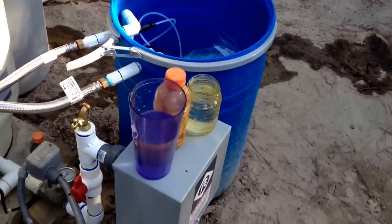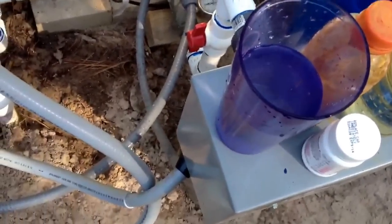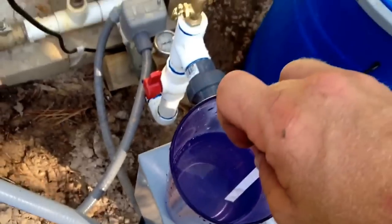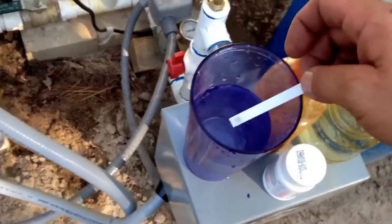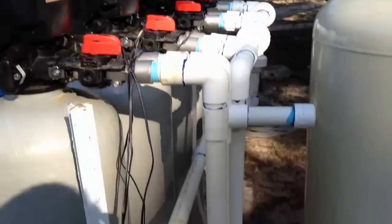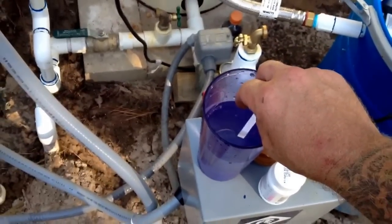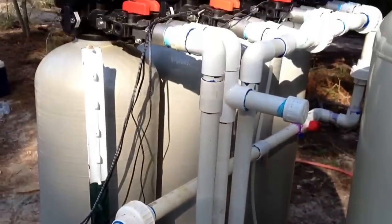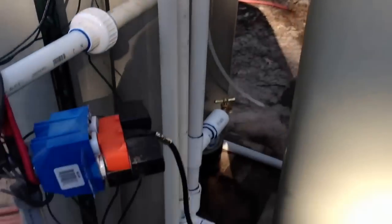You can see the oxygen bubbles in the water. This time I'm going to do a 30-second dip for iron, because there are two charts on this thing. The one-second dip obviously hadn't changed any color — there's going to be zero iron when we're done. This system completely removes it altogether. There will be nothing left. It's oxidizing all the iron, causing it to precipitate, and then we're trapping it in the filter. The calcite corosex blend raises the pH, and the softener softens the water.